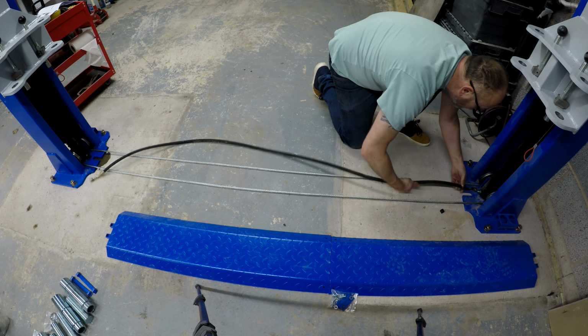What do we do with a little bit of plastic? There it is on top. Okay, alright, so that's your motor wiring. So your limit switch wiring goes in here. Doesn't matter which way around. It is a pain in the backside, so I took the middle screw out, pulled it out to give myself more of a chance of getting the wiring in, and screwed it back in.